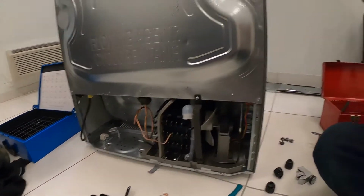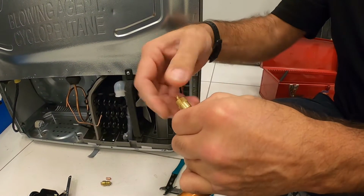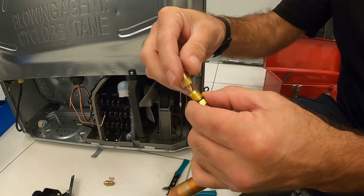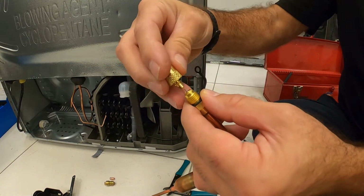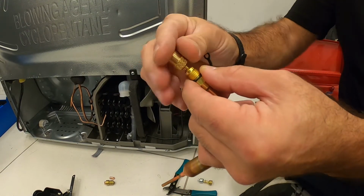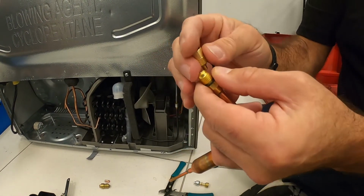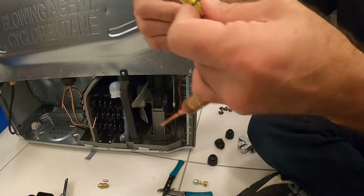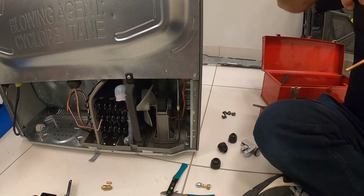One thing very important, you might want to catch that, let's unplug this: the valve is usually not screwed in. You see, it's very loose. I did half a turn and it's undone. So when you Lokring, you have to go and close that valve. Otherwise, it's a leak. If you don't screw it back, it's going to leak for sure. Because just this cap, unless you take this cap with a plier and squeeze it very tight, it's going to leak.